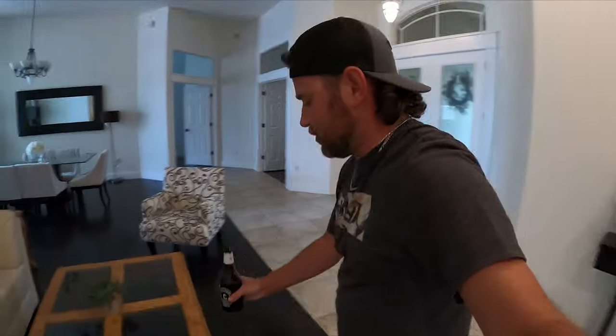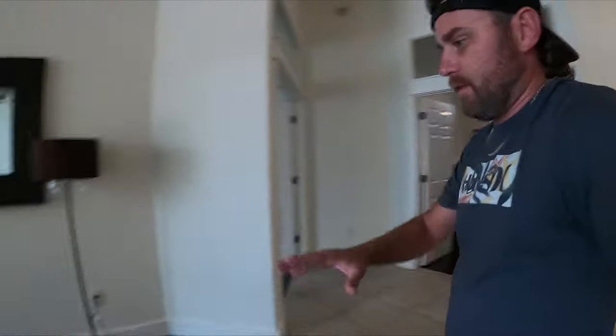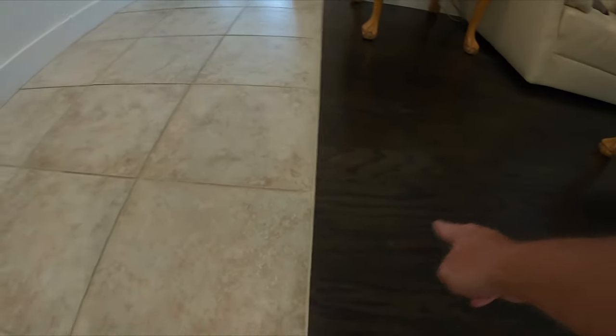When I said I glued it, I don't know if people understood me correctly. The only parts I glued were the edge. The rest of the floor — all this stuff — is free floating, so if it needs to expand, this part could all expand. The only part that's glued is right here where I'm running my finger. After two and a half years, I'll say this: I think I could have done one thing a little better — rather than running a straight bead of adhesive, I should have zigzagged it. I think I would have had better adhesion and that spot probably wouldn't have happened.